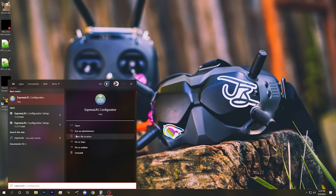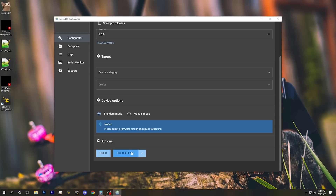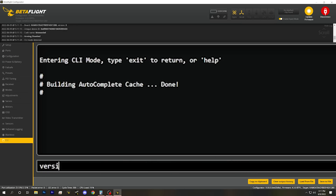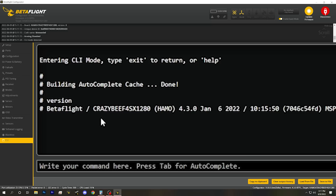There is a complexity to using an SPI-based receiver, and that's going to be the main topic of this video. If you've got experience with ExpressLRS, you probably think you configure it by opening ExpressLRS Configurator, setting up the options, then compiling, building, and flashing firmware. That's true for serial-based ExpressLRS receivers, but not for SPI-based ones. With an SPI-based receiver, the ExpressLRS code is actually baked into Betaflight itself. If we go to the CLI and type 'version,' this firmware is CrazyBF4SX1280 — the SX1280 referring to the chip that runs the ExpressLRS code. This is a custom build of Betaflight that includes all the ExpressLRS logic in the Betaflight codebase.